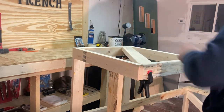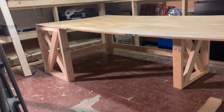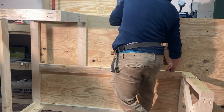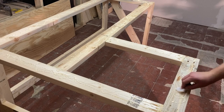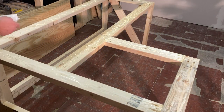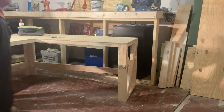I purposely made the desk four feet wide so I could just put the plywood right on top — it'll still need cut, but how I made it a perfect cut: I just took finishing nails, put them in all the corners so it's nice and tight, then drew a line right where it needed to be cut. It ended up working out pretty well — when I line it up it fits pretty much perfect. I used my sander to get it down right where I wanted it, and I can fill those little tiny finishing nail holes pretty easily. Now we're going to glue it — I'm just spreading it out and then we're going to wait. After work tomorrow I'll finish everything. After about 20 hours the glue is looking nice and tight and I'm really liking how the top is looking. Now I just need to sand it, paint it, and stain it.